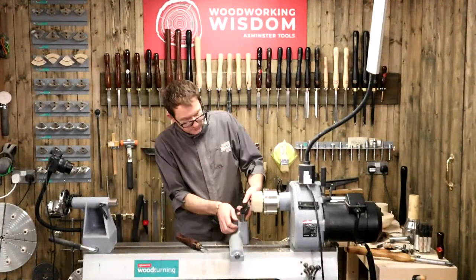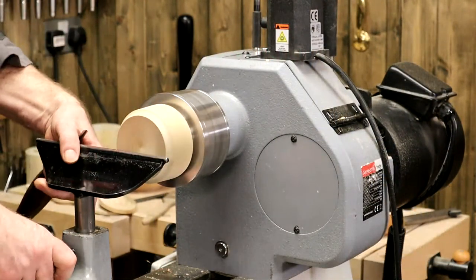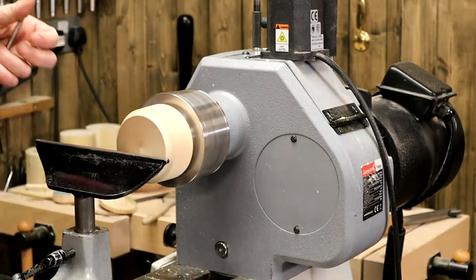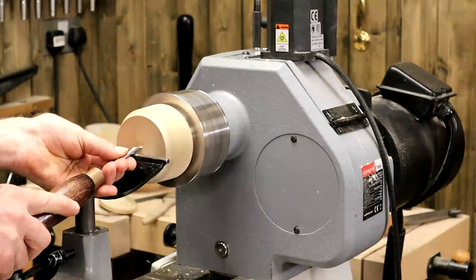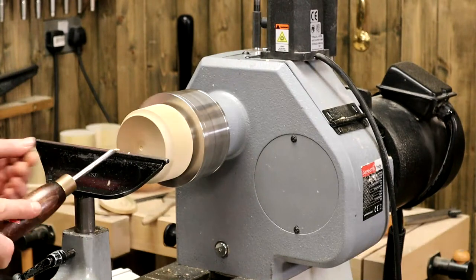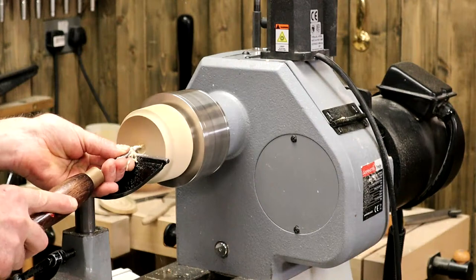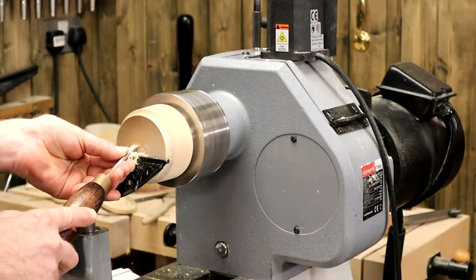So we're getting lathe on. We're going to start with that round cove tool. We're going to start with real basic stuff. I can put my handle down low. I need to play with the turret just to come down so I can get into the middle. Beautiful in this cove tool. Have a bit of go-go juice, a bit more speed. We can use this a bit like your gouge. So we're just going to do a little curve in there.